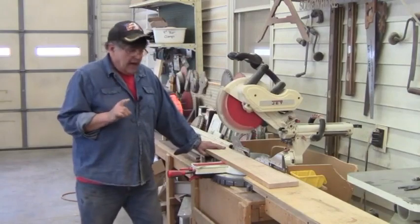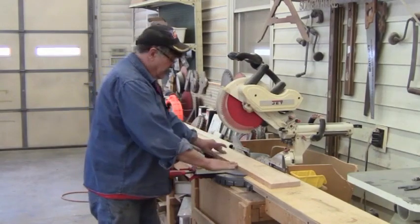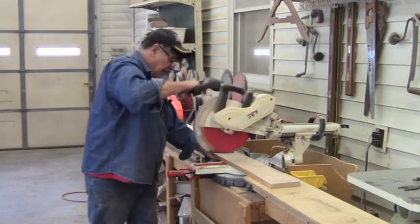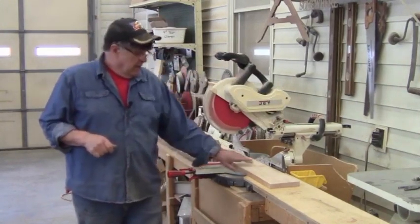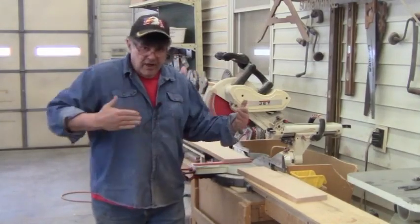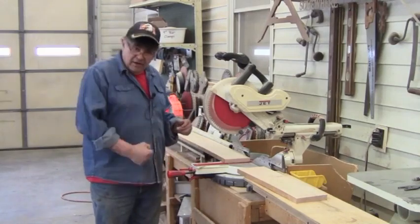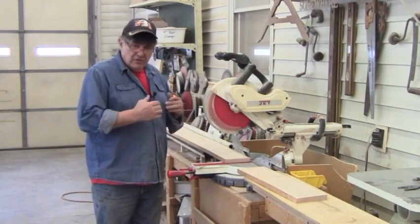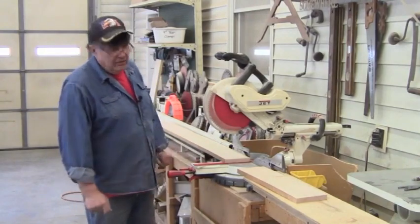First chop is in the back. That allows this piece of wood to flex and allows it to go back. Second chop finishes it off. You're not running it. You're making a plunge cut, then another plunge cut, so that the wood didn't have a chance to pinch on you. That's the way you handle that one.